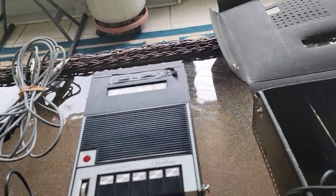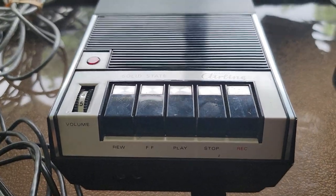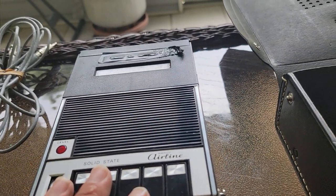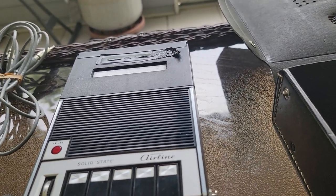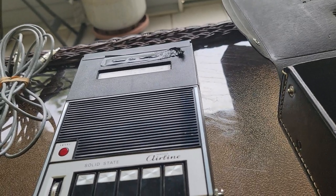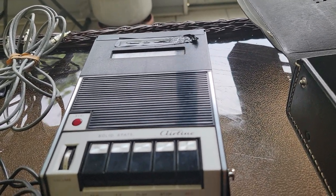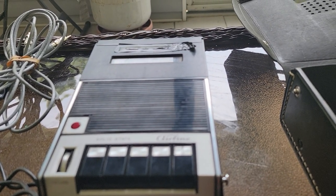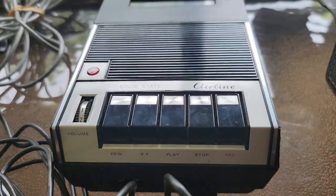This is a fine machine — solid metal record head, playback head, metal capstan. There are radio forums and places you can send it if you don't know how to work on it. One thing I stress: when you find something vintage, don't just plug it in. You could damage components — capacitors out of tolerance, bad electrolytics, or other issues. Test all areas of the circuits before doing anything.